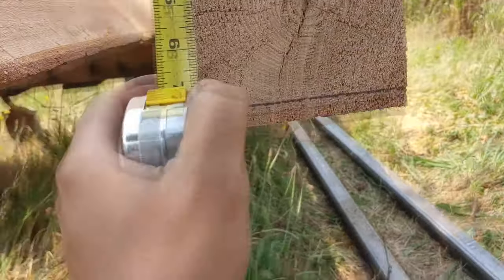Now, looking at our rem pieces, these two I could get a 1x2, 1x2.5, and a 1x3, which I'm probably not going to chase. Those are probably just going to be scrap. This one I can get a nice 1x6.5 out of, and this one as well, 1x6.5. And then I'm gonna take about 3/8 or 1/2 inch for a kerf out of this when I cut across the top. So the waste on both the top of these are gonna be not enough to get anything out of. So I'll get set up to cut some 1-inch boards, and we'll slab out that one and that one. And we'll see what we get with those two.